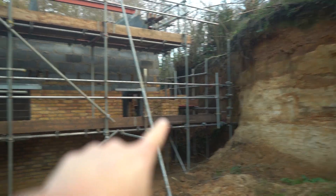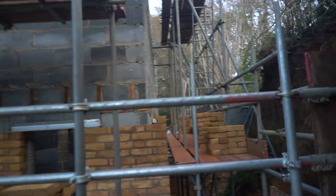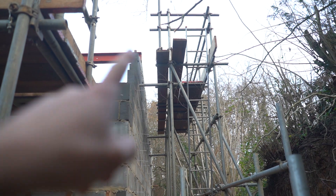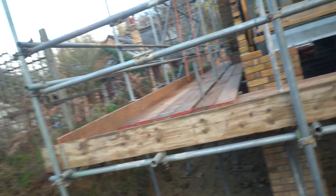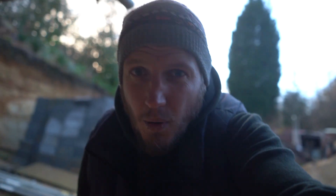We've got one lift all the way around here for me to finish the brickwork. This goes down this side, all the way down to the front. I've set up a couple of stacks of bricks to do the corners. We've got one lift up here for the gable — the top of the gable — so the chippies can do the roof. We've got this lift along here which is 400 down from each edge, so there's a plate there. The roof's going to go up back here, and we've got another lift through here — the roof goes along here again. Up there is another lift of the gable, and as I've finished this brickwork round here, this is just one level straight the way through.